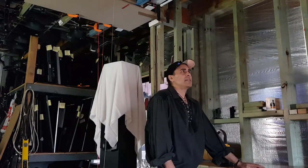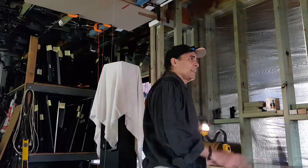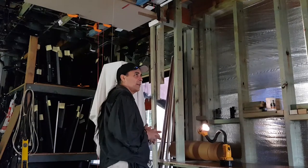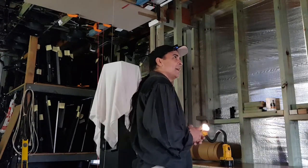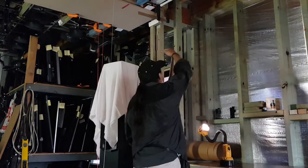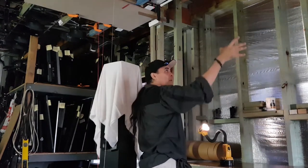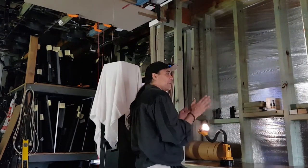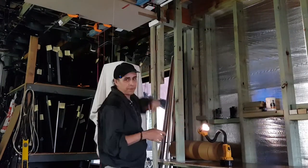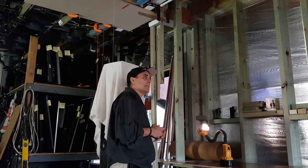So these screens, yes. But actually, what I just showed you, that's why I showed you. I do have to put these in because I need to hang the screens on those. So what I just said isn't a waste of time. I do need those up there because then I need to frame it right across between the pillars, and that's what the back screen, the black one down there, will actually sit on. And if I have to pack it out a little bit, I can always pack it out to clear the frame of the screen up the top here, the 180 inch screen.